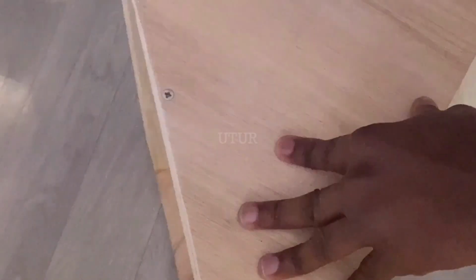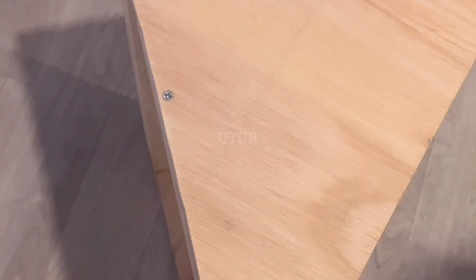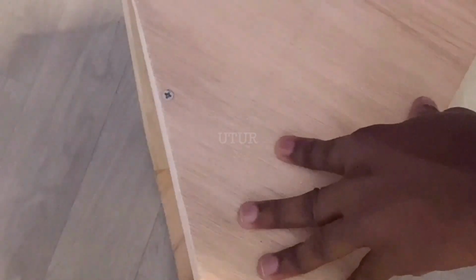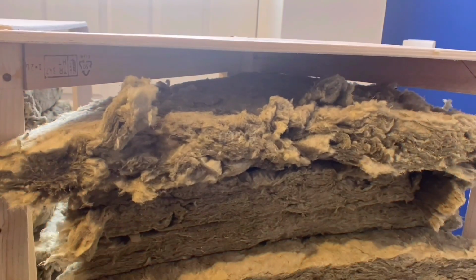And if you also zoom out on the hardwood plywood board, you will notice that certain edges are receding on the inside, and that's because the hardwood plywood sectionally cut diagonal boards were freehand cuts with the use of a circular saw. Pretty much just cut through a cutting line, so there will be a marginal degree of human error when fabricating or cutting the hardwood plywood base boards. The pine wood side panel reinforcement helps to accommodate this deviation by providing a seamless uniform look when the acoustic dampening fabric latches onto the BassTrap assembly.